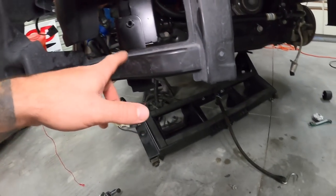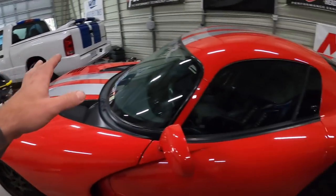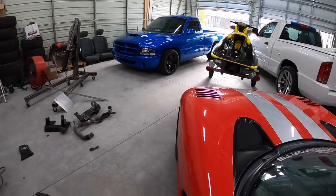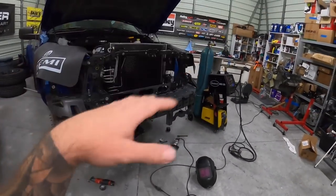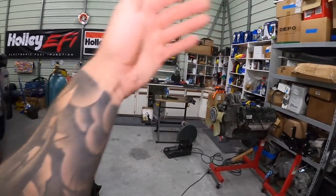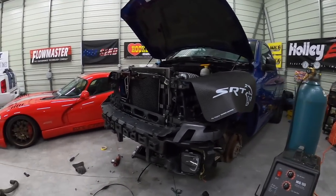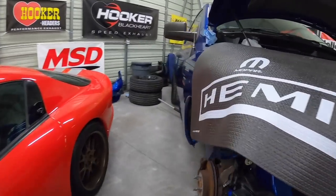Last night I painted the brackets — finished product looks great with chassis paint. One safety note: when grinding and welding you don't want spray going onto adjacent vehicles. I moved everything out and was very conscious of where I angled the grinder. Those hot little metal flakes will embed themselves in paint and glass, so you definitely want to be aware of that.